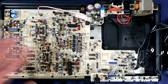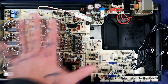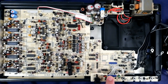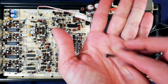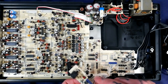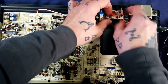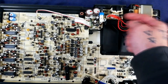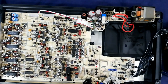Moving on to getting the printed circuit boards away from the plastic case - you might need to solder some parts, or do signal tracing and need a board out of its case. We'll take off this little daughter board that has a socket for external control, shuttle buttons, and record and playback indicator LEDs. There's one screw and then a second - these are the centimetre-and-a-half long wide ferrule screws. The board will dangle via its wires which are soldered at both ends. The transformer wires are very stiff so I'll use pliers to pull those out.